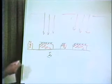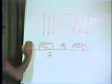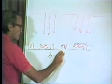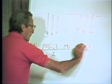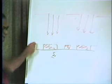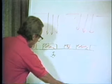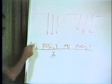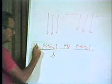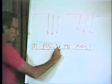And then the red stuff that I showed there is dissolved by another chemical because it was only a tool and a scaffolding. And so we get to this picture. Remember that these are insulators. And this is a conductor. So the next step is to evaporate some silicon again and to make a contact. It goes on and on, and I'm not going to go on and on. But the next level is, say, silicon or transistor material, which is silicon with something dissolved in it, laid down here in a layer all over, filling all this.